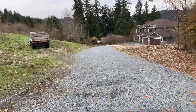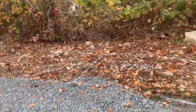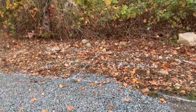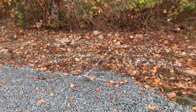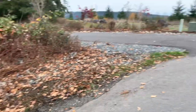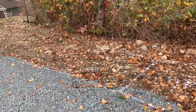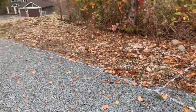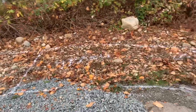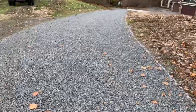Over here — this is something that Dan and I talked to the customer about — whether or not we could do a 5-foot by 15-foot asphalt pad here for their trash cans, serving three different houses. If we don't have enough mix to do 15 feet, let's try 10 feet. If we can't do 10 feet, then so be it. This trash pad would be the last thing we add on. I've sprayed in the white line here going down the hill.